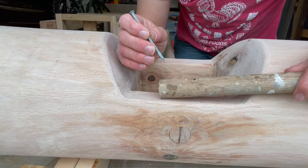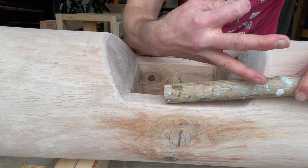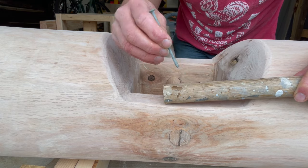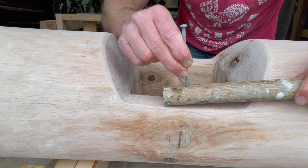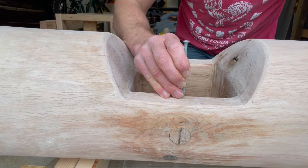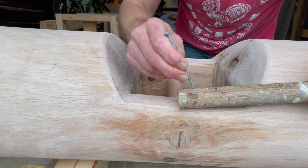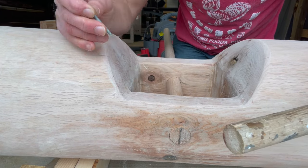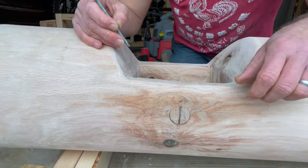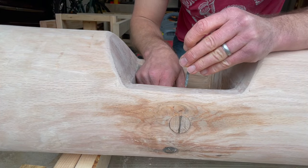When doing this sort of joinery, if I'm cutting with the grain of the dowel rod, I don't want to split all the way down while cutting the relief cut. Typically you'd just drill a hole where you want the relief cut to stop. This pin hole that we're drilling is going to serve as that stopping hole — we'll cut all the way back to where the pin is, then when we assemble, we'll put it into place and put the pin fully in.